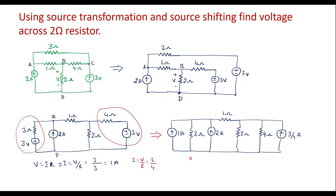Now I will further reduce this circuit. We can see that the 1 amp current source and the 2 amp current source are in parallel — I can replace these two by a single current source of magnitude 3 amp, because both are in the same direction so they add up. So the 1 amp and 2 amp current sources are replaced by a resultant 3 amp current source.